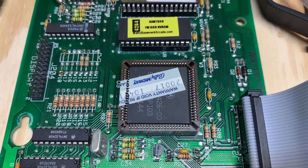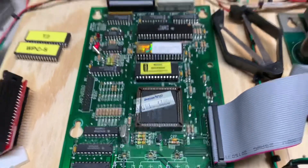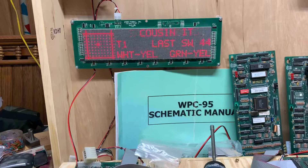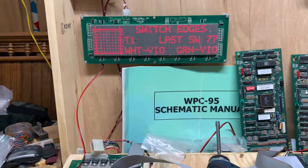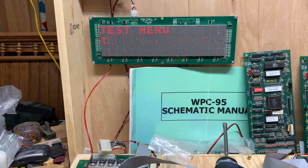So I removed the ASIC, cleaned up the pins a little bit, and reseated it. You can see our ground shorts are gone, and now I'm going to use my tester to walk across the diagonal to show that all the rows and all the columns are working. These are some direct switches — we can show that they're working.